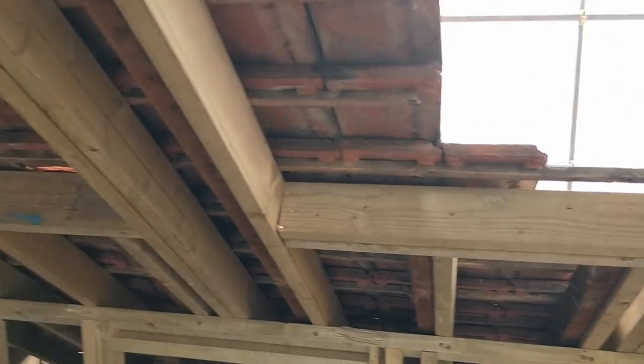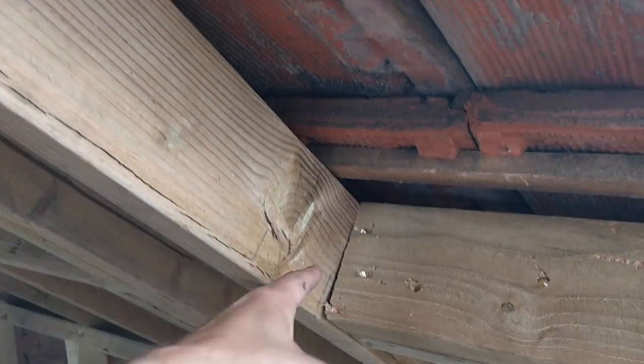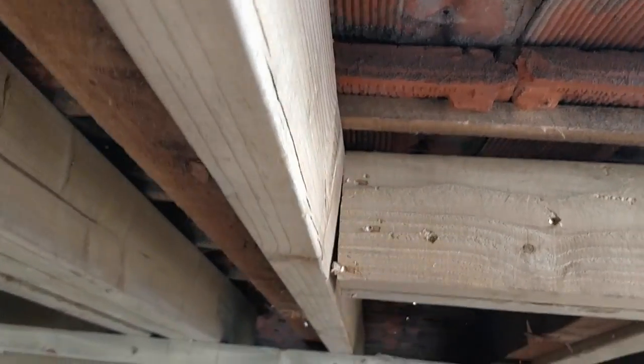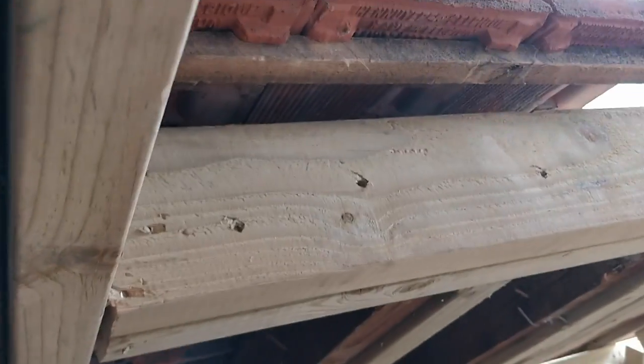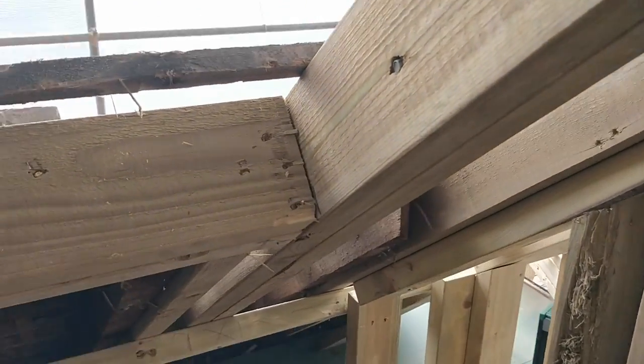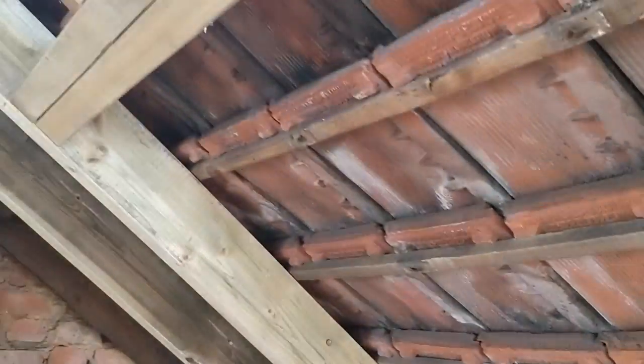And as quick as that we've got the two Velux openings in there — 800mm wide, two timbers at the top and two timbers at the bottom; it's as simple as that. Very, very strong — we've put loads of screws and nails in there so it's not going anywhere. There's a little bit of twist on this timber, which is why this is slightly out. These are all cut square, but there's a bit of twist in the timber — natural material, nothing you can do — so we've put some extra bracings on this side and timber locks as well. Those are the Velux openings cut.